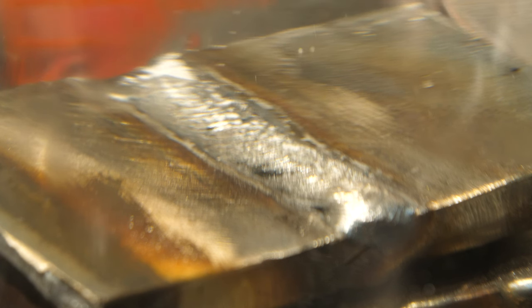If you have comments, questions, or thoughts feel free to leave them. This is a controversial topic, and I'll say right now this is not an end-all be-all - there are too many variables. You should always use your 7018s out of a hermetically sealed pack and keep moisture out of them. If you're welding high strength steel you must abide by proper rod oven and storage requirements. Thanks for sticking around - hopefully you learned something. Until next time.